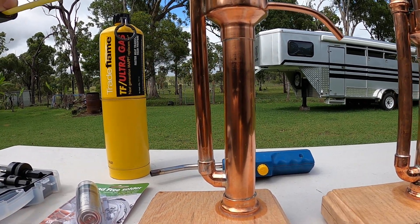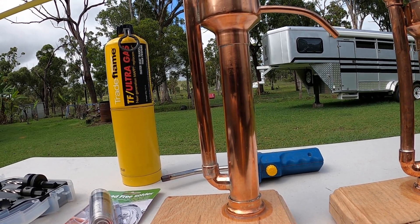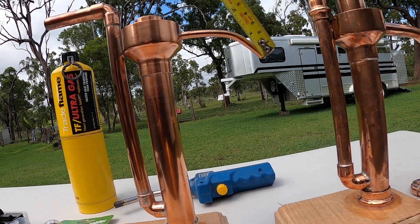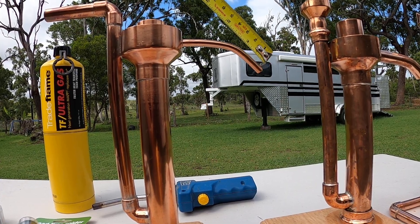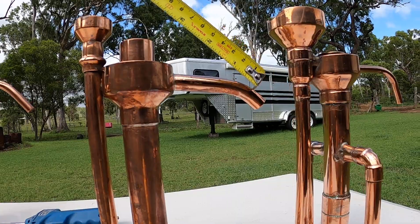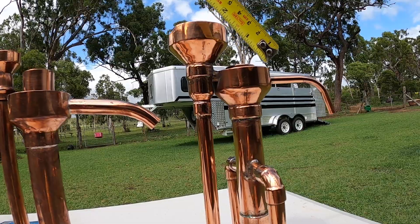This part needs to be higher than the overflow. As you can see, that's your inlet, that will be your overflow, and that's your outlet. The outlet is about a quarter-inch — quarter-inch tubing that I use — though you can also use half-inch like this one, and you want to make it about three inches long.